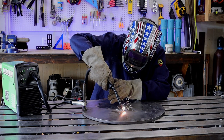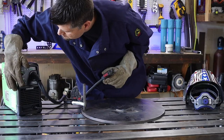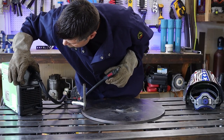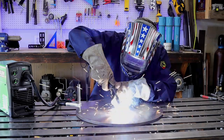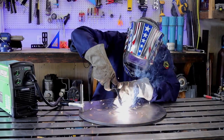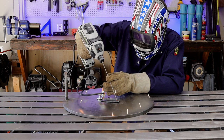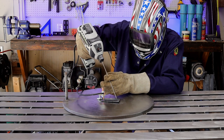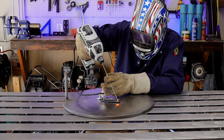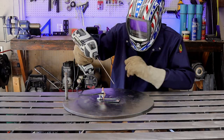Started out with the Titanium with middle settings, and that's a definite no. Turn the settings down and, well, it is throwing a spark. Still not what I would consider a full weld by all means, but we're getting there. And with how the Titanium ran, it's no surprise that the generator can't keep up with the stick welder. On the lowest settings, I can barely get a spark, and that's about it.